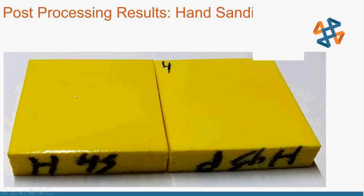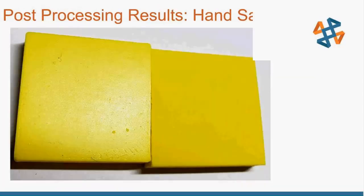The other trick is when you're clear coating, you have to have a really clean room. We have a nice lab in the back, but we're still getting particulate on our prints for whatever reason. So you have to have a really clean, designated paint booth area that doesn't have people walking in and out, because you're going to get stuff stuck in your paint. So when you have finishing, you're going to have a dedicated area for your spray painting and post-processing, because any dust will get on it.